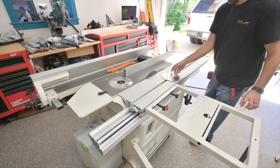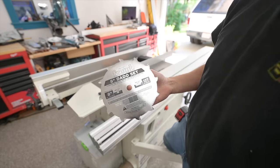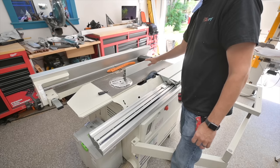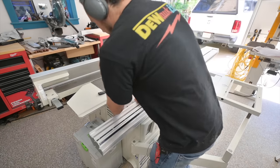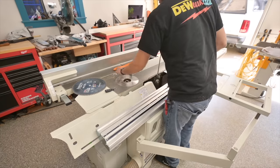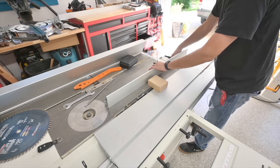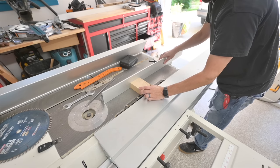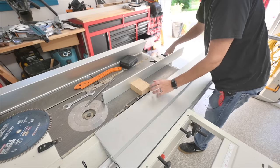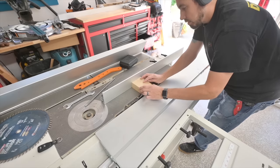First thing I need to do is switch out my blade with this quarter-inch dado blade. I'll get this popped in and then I'll be using my fence here to index so I can get these things exactly where they need to be. I've got this little block here and this is going to be my setup block so I can get this registered with my fence, then I can tighten my fence down so that looks good.